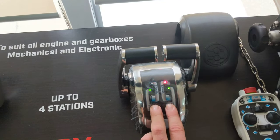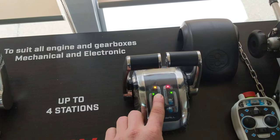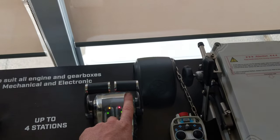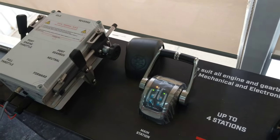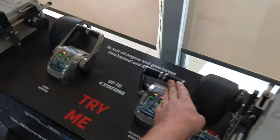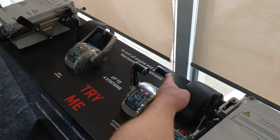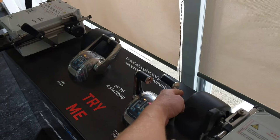You've also got the ability to hold down the two buttons here which turns the yellow light on, which is effectively a sync. So what that means is that the one lever, the right hand lever, will do both the starboard and the port actuator boxes together. So if I just zoom out a bit and click it forward into gear, it controls both engines accordingly. Nice and simple - that's the whole point of these flexible controls.